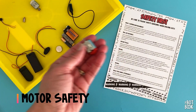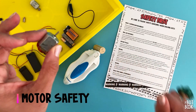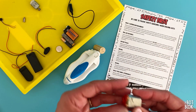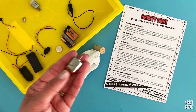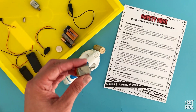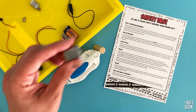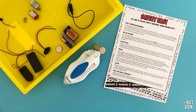Next up, you're going to be using some motors. These have spinning rotors. Keep your eyes and hands away from spinning parts, and disconnect the battery because these can overheat. If you sense that your motors are getting hot or smell a little smoky at all, disconnect immediately. Set them aside, replace them with a different motor, or let them cool completely and try again.